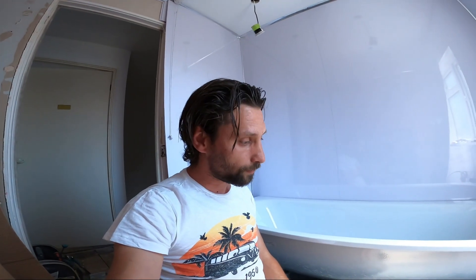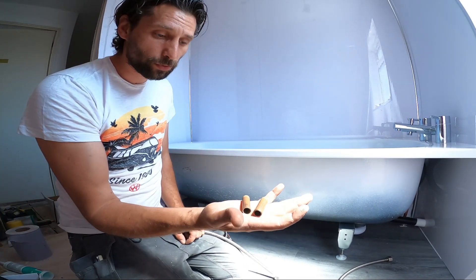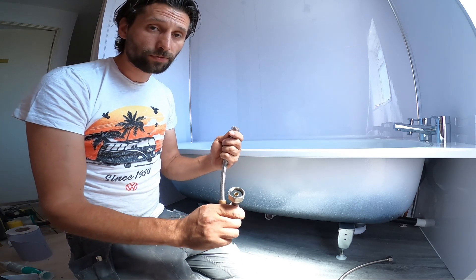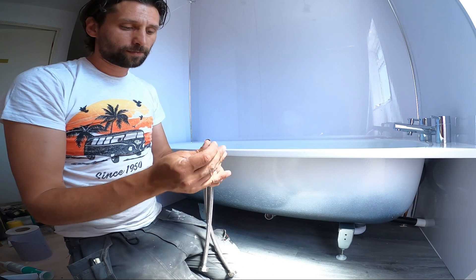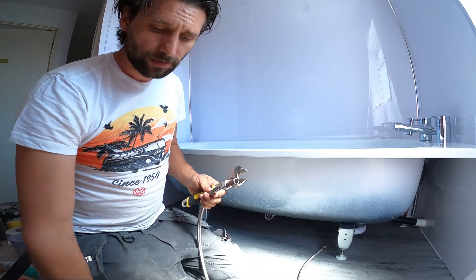We are under the bathtub and I'm going to put this waste pipe outside — that is going to be connected at a later stage to the soil pipe. This is our trap, and that is going to be our connection. One more job done. Next I need to seal all the bathtub, make sure it goes against the wall with no gaps for water to pass through, and then reconnect the waste pipe. I'll cut two pieces of copper to connect the flexible 22mm connectors.